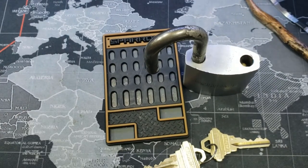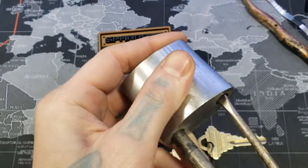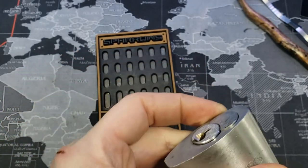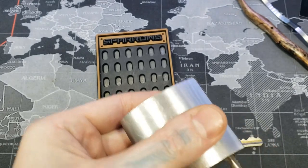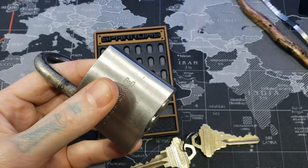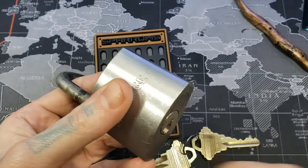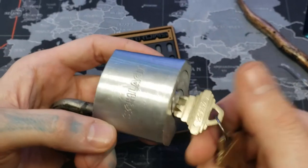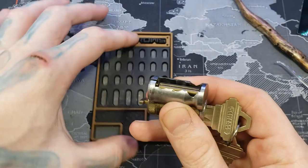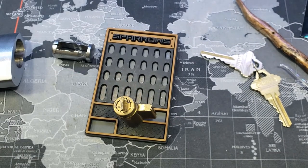Alright, let's go with that. So for this one it's really odd — there's just a screw down in here. The screw doesn't come all the way out; it just releases the core a little bit from the back of the Bible sleeve. You can't pull it out directly, so we need to grab it. I reset the key, put the key in, turn, and there we go — it pulls out. This is what I was talking about with the Bible sleeve: this goes up top to make the cylinder fit, then we'll go ahead and take this apart.